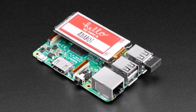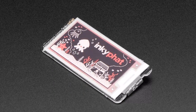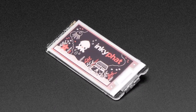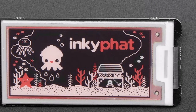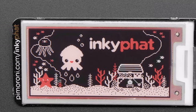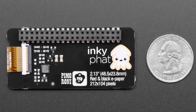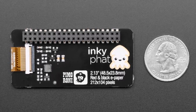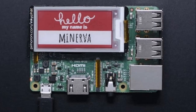Simply plug it into any compatible Raspberry Pi mini PC and you have a 2.13 EPD display offering a resolution of 212x104 pixels in three color options: white, black, and red. Broadcast your tweets, the weather, or even graphing data — e-ink is great for displays that don't change often, due to the three-second display change cycle. But the contrast and readability cannot be beat.